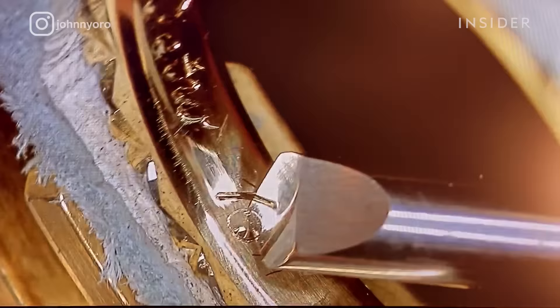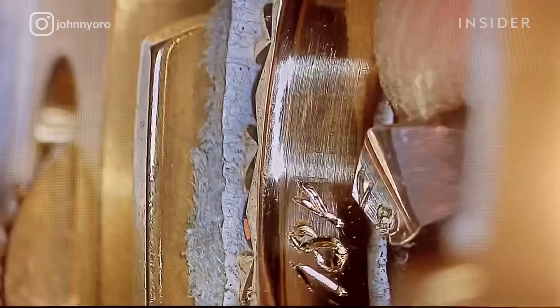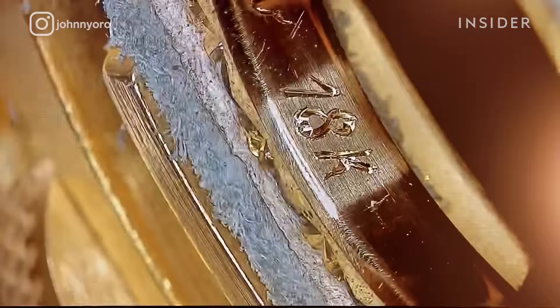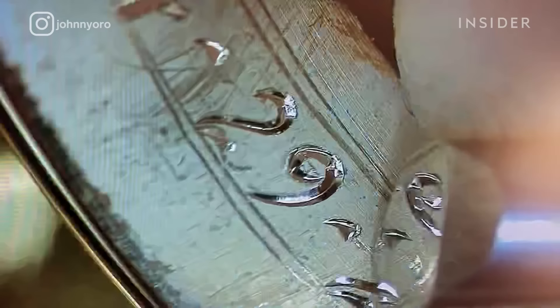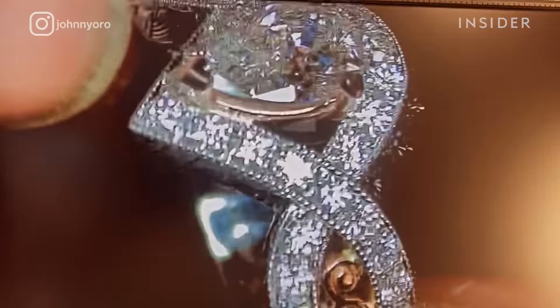For my inside ring engraving, I draw directly onto the piece. It took me years to get to the point where I'm able to just use Chinese white and a pencil to accurately draw different types of calligraphy directly onto the ring. I jokingly tell new engravers that what they don't realize they're also signing up for is calligraphy as a hobby. A common mistake for new engravers is that they start engraving too deep — engraving is a very surface-level sort of thing when you're doing letters and numbers.